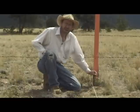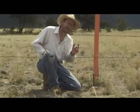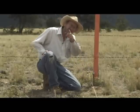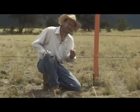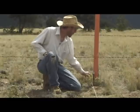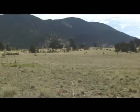The first thing you've got to do is find your property boundary. This here is the survey mark. We're going to put a stake in about two inches from that to run a string line that runs the entire length of our fence. This string line is what we line up the fence onto to keep it straight. Then once you find that, just put in the stake, tie on a string, find your other end, and run a line.